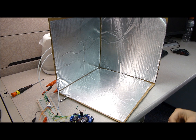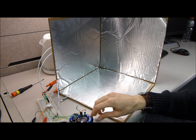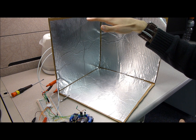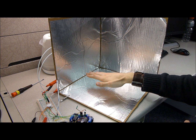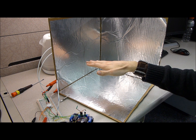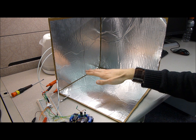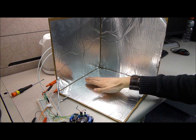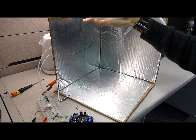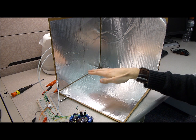And to show that this is working, I have this Adafruit motor controller, and you'll actually see it move as I move my hand. So right now, when I bring my hand all the way down, it's calibrating for the first time. And now when my hand is in the middle, it might have a little bit of noise, but it should be not moving at all. Now if I want the robot to go down, I move my hand down, and that would be the down motor, and obviously send it down. But if I want the robot to go up, then I move my hand up, and the motor moves in the reverse direction. And that is essentially how this is going to work for the SeaPerch robot.